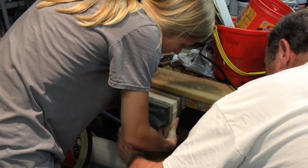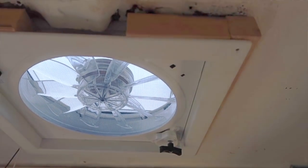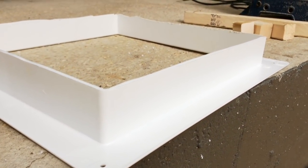Because of our fiberglass camper, it's kind of unique compared to other campers — the ceiling on ours is only about a quarter of an inch thick, so it's a pretty thin ceiling between the outside and the inside. We did make a few modifications: we built a two-inch wooden buffer to get a little extra stability. Along with that, we trimmed the inside plastic liner piece that comes with the Fantastic Fan, which had a lip that we don't have enough roof depth for, so we trimmed it down and got it more flush.